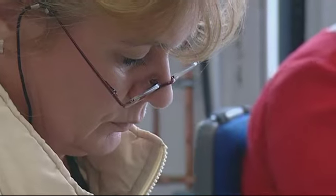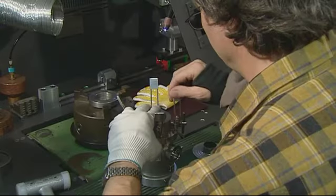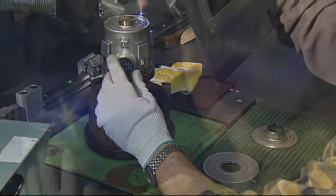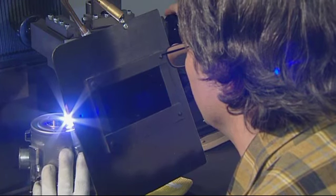For cabling, flexible circuit boards are used that form a secure connection between the strain gauges and housing. The load cells are hermetically sealed in a special microplasma welding process that enables a high degree of strength. This welded joint can withstand very heavy dynamic loads, such as those occurring when a vehicle is being weighed.